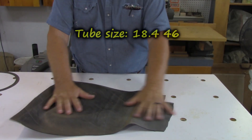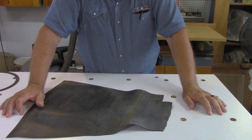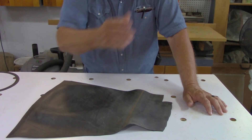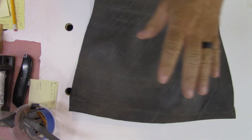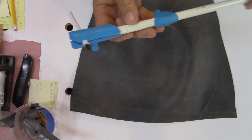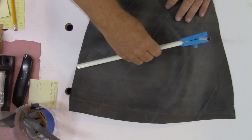So I came up with a solution: a tractor inner tube, or a piece of a tractor inner tube. Inner tubes are airtight — they hold air — so they might work. To make the gasket for the pressure pot lid, simply grab the measurements off the lid. I took my compass and replaced the pencil with an ink pen, and just start in the center.